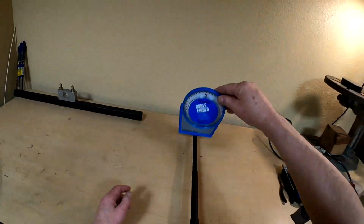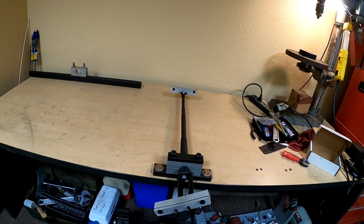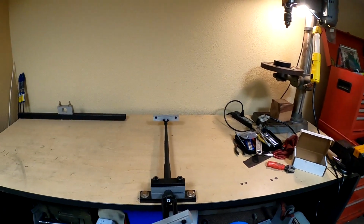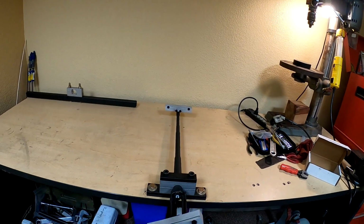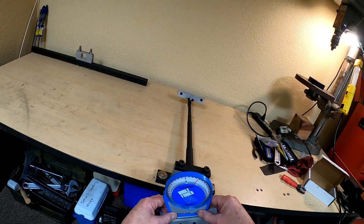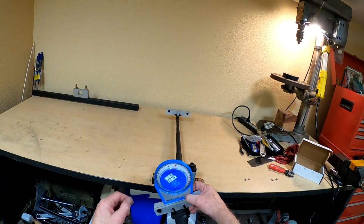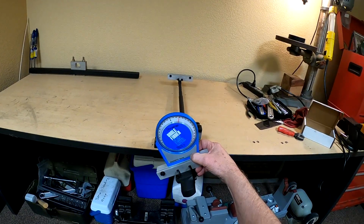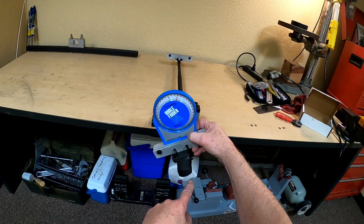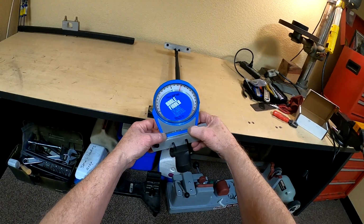And so then I hand screwed on the receiver, gave it hand tight, because I'm curious to see how many degrees of rotation I have to go. I've seen them as high as 38 degrees, but they should be somewhere in the 25 to 30 range, typically, I think, is my understanding of it. And if you look, we are about 28 degrees right there, so that's good. That's how much this has to be rotated until that gets to 0 to match the front. And that's what they call timing the barrel.